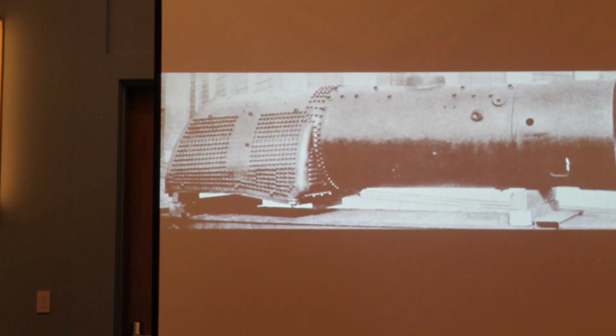Is that one of the 280s that had such real high boiler pressure? That one, no, not that one. Those were water tube boilers. They weren't a typical fire tube. They could run really high pressures. It's just a series of tubes in there. It's not that type of boiler. It looked kind of like that. It was a standard D&H 280. They just reboiled it. Yes, reboiled it. Yep, exactly. Thank you.